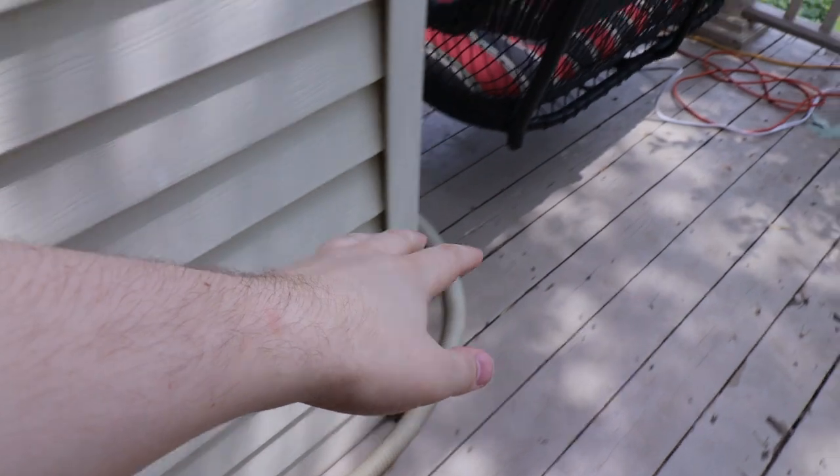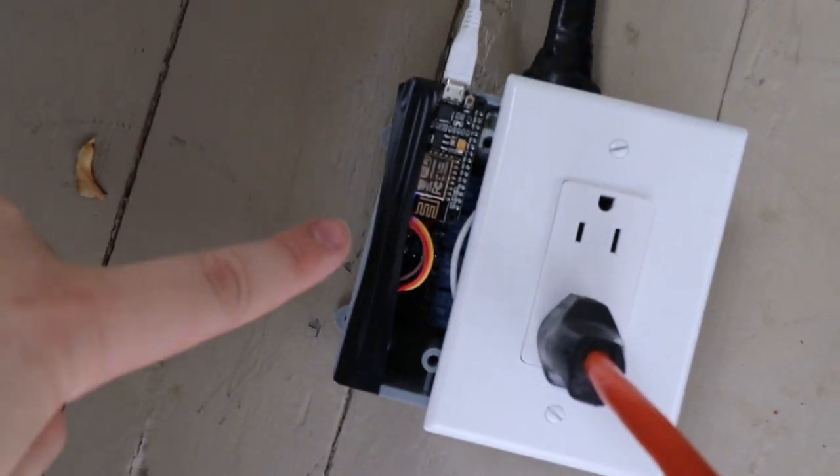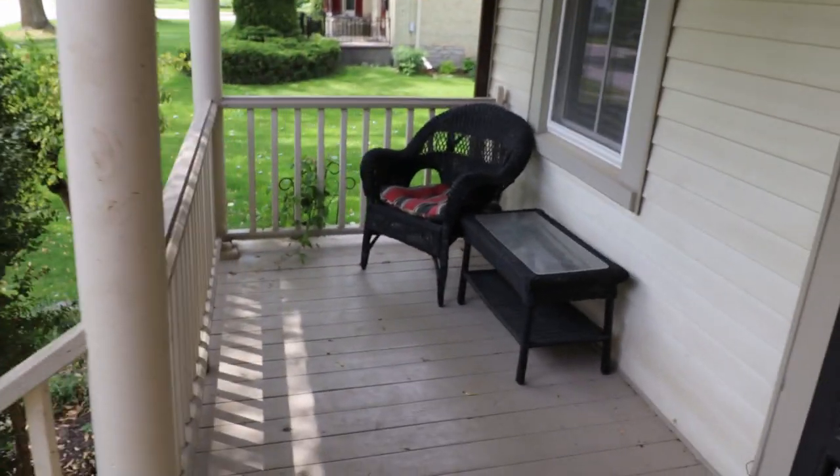This hose leads all the way over to here. This ESP8266, which is an Arduino, is connected through Wi-Fi to the computer. If there is one incorrect answer, this instructs the fog machine right here to start filling the hose with fog. If they have three incorrect answers, it will announce that it needs to give the steam, and then it will turn on the leaf blower — which is also under there — to force all the fog through the tube and out there.